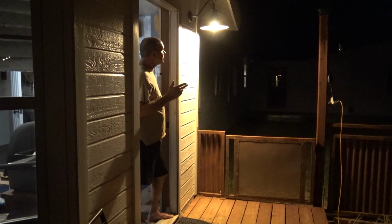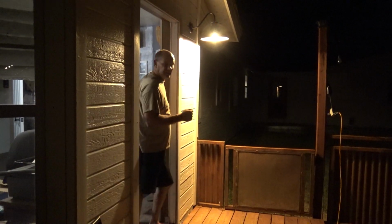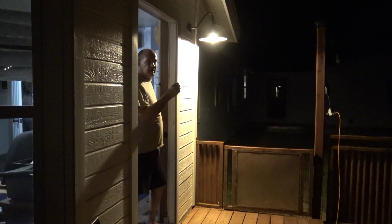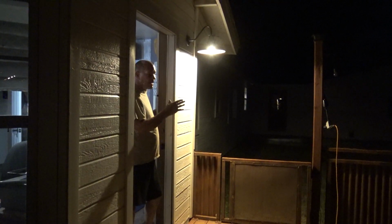So the first phase is just power on, and so that'll be this plus motion detector, and then once that happens, it goes like that. Okay, number two, if I hit the switch twice in 2 seconds, it's just going to be motion detector only, just like that. Okay, so now if I turn off the switch, turn it back on, it'll just be dusk to dawn. So that will be whatever the sun comes up, it'll automatically kick down. The instructions are easy to follow, just the 3 steps on the 3 different phases of what can be done. So don't worry about it, it's all in there.